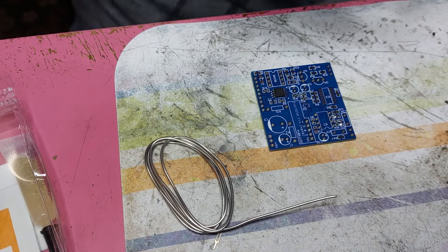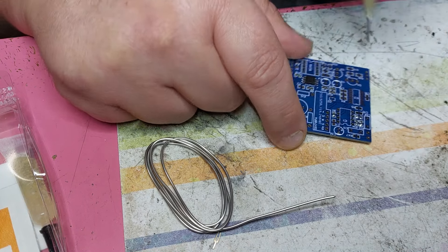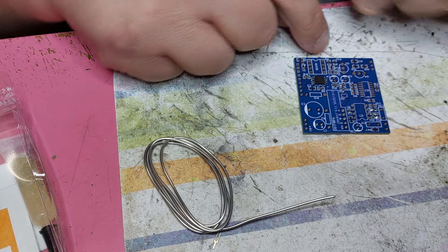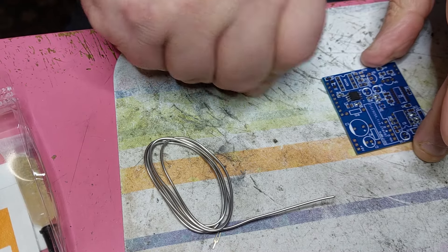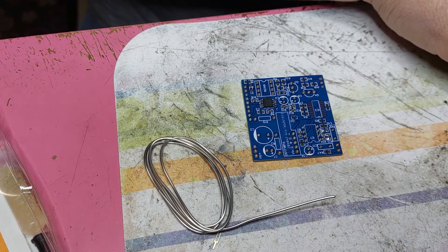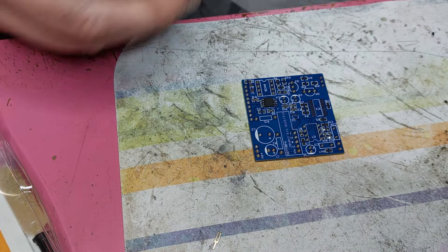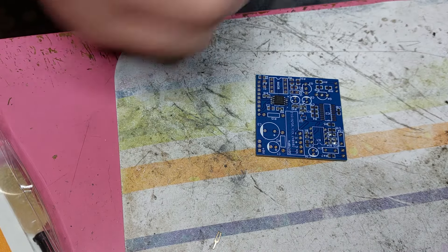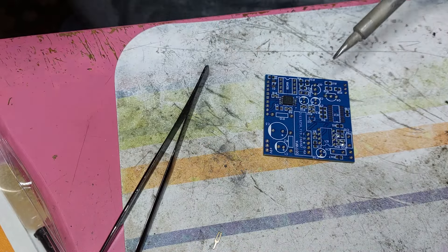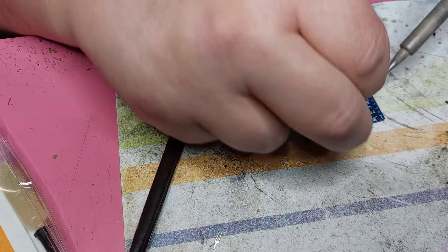So first thing I'm going to do is put a lot of flux on all pins. I'm going to try to remove this without touching the resistors around it - there's a bit of hot glue here. I'm going to add a bit of this alloy to the solder. Just a little bit - you don't need much. Just like this, and then a little bit on the other side. Actually that was a bit too much already.